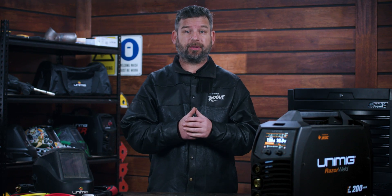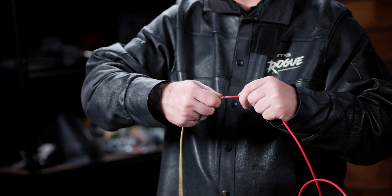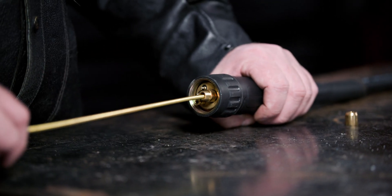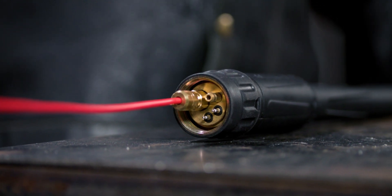Replacing a Teflon liner when working with aluminium is mostly the same as replacing a steel liner, except there are a few extra steps. Once the old liner has been pulled out, you will need to attach a neck spring to the top of the new liner before you can insert it. The neck spring keeps the liner rigid, so it can be fed into the torch with no issues and keeps the wire from kinking. It also helps protect the liner from getting too hot and melting inside the torch. The neck spring will butt up against where the tip holder screws inside the neck of the torch. The excess liner will instead hang out the back of the torch.